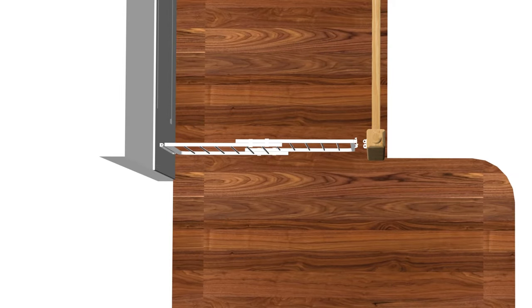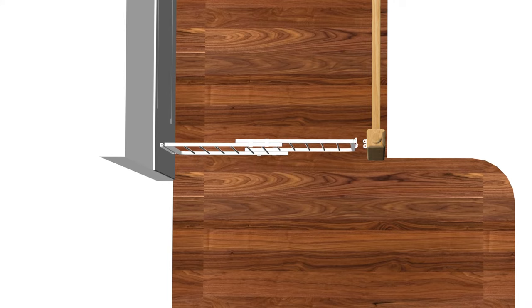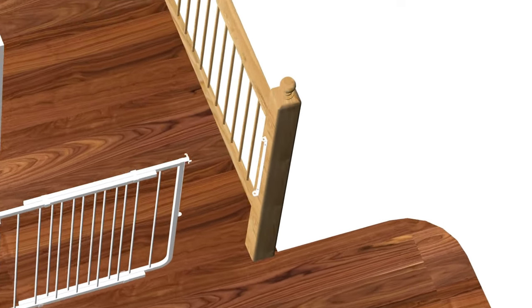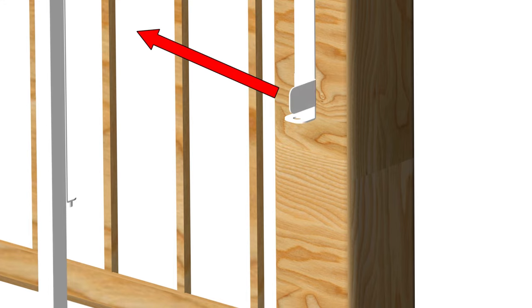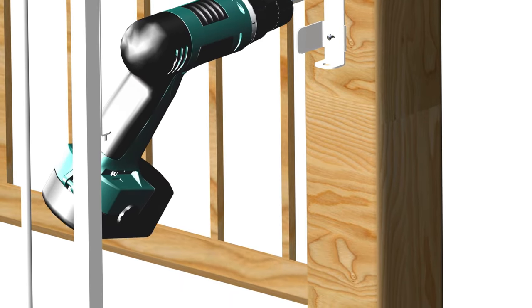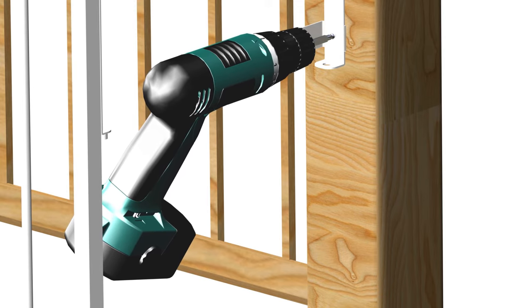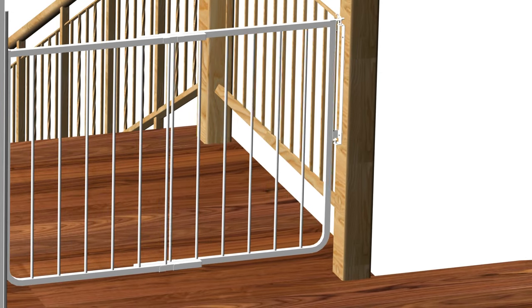The gate can now be opened in both directions. If you prefer the door to swing in both directions, Step 4 is now complete and you may proceed to Step 5. If you prefer the gate to open only in one direction, you will need to install the optional one-way stop bracket Part M before you insert the Phillips screw on the bottom of Part H. Simply place the slotted hole against the latch bracket, with the long side oriented where you don't want the door to swing open. For example, if you want the gate to open in one direction, simply install the bracket facing that way. After deciding which direction you want the door to swing, insert the Phillips screw Part C and tighten using a screwdriver. This concludes Step 4.